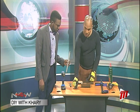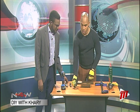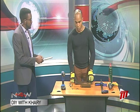You'll also need 4 screws because this flange has 4 holes. These screws are 1.25 inch. Then you need 2.5 inch long screws to attach your long piece here to the base, which is your 1x6 piece. So the base going on top of that? No, the base. Well, because you have to. Let me see. Go ahead.